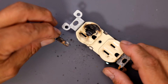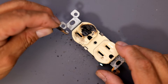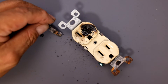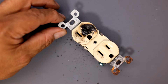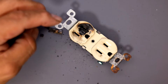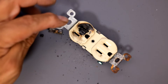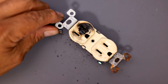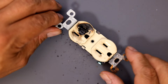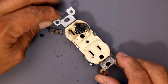Usually the plug is not fitting properly in the outlet, and that little bit of gap space can do this. Pulling too much current can do this too. She had a dryer and a refrigerator in there — the refrigerator gets a hard start on the compressor, and over time those hard starts pull too much current momentarily, which is just enough to start heating things up and cause this to happen. If you see this or smell something and notice where it's coming from, do your best to unplug that appliance.